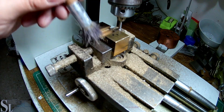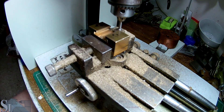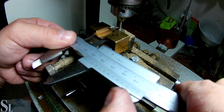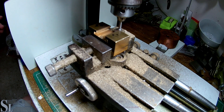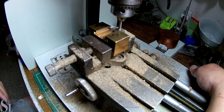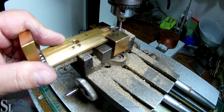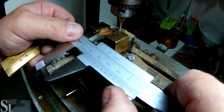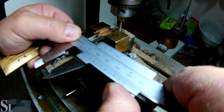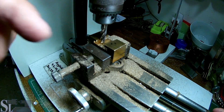Normally I'd order a brand new 3x3 Woodruff key cutter — not a junk Chinese Dremel cutter — and be done with it, but we're not exactly cutting it normally here. We're shy over 20. I did plan on 0.1mm overhang just to make sure. Does it slide in? Well, it does. It seems that the width here is a bit too small, and we're touching. We're going to remove 0.1mm and 0.1mm, and here we go.